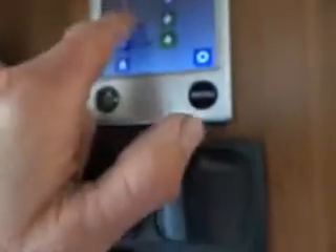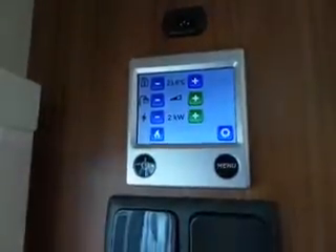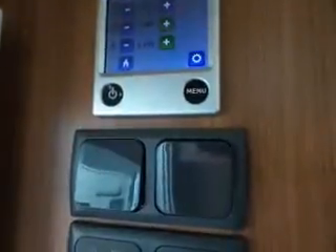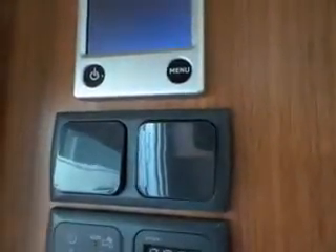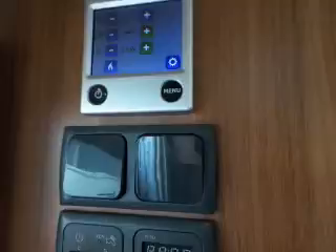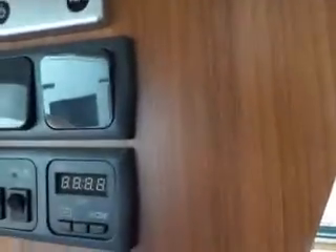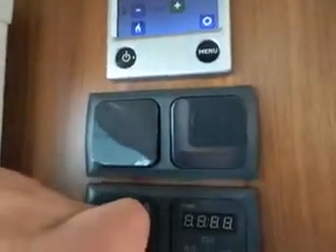Next one along is water heating. So I press that minus button — that's water heating off. If I press the plus button, it goes green. You'll see half a triangle's coloured in — that's your normal running for your water heating. If you want to boost it, press the plus button again. What that will now do is concentrate all the heating on the hot water tank, and also switch your circulation pump off. The boost will run for about 30 minutes, then it will revert back to normal running — or you can switch it back manually. Then the heating will come on, as long as it's in that temperature range. So if you just want to switch it on without setting a timer, just press that plus button.